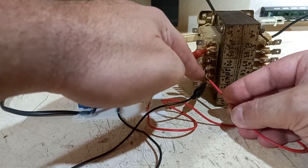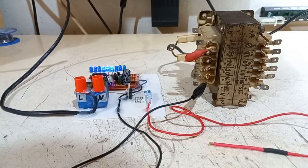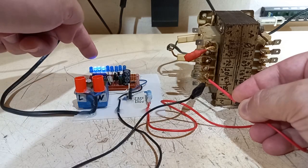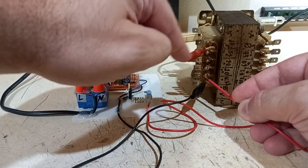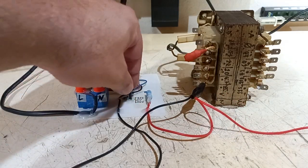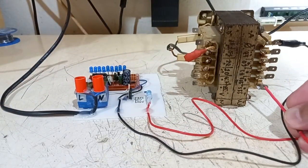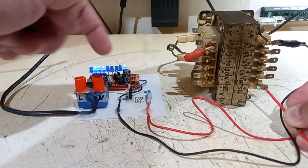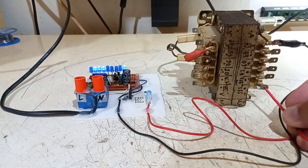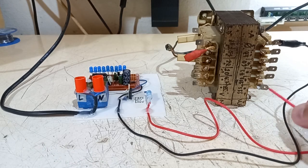You can see the phase is reversed — this 6.3 V winding is in opposite phase to mains. If I reverse the polarity of the transformer from the primary and touch here, now the phase is correct: the 6.3 V output is in phase with mains. We can test higher voltages too — here's the 115 V output, and it's in phase again because I wound this transformer with both secondaries in phase. If I switch the plug of the transformer, now it's opposite.